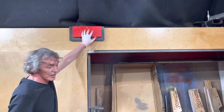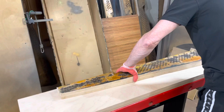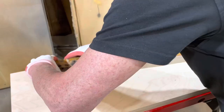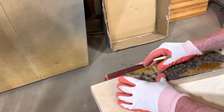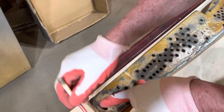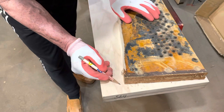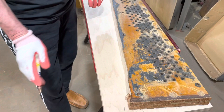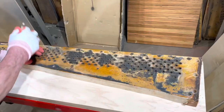Of course we have the place with the lights — always lights, it's very important. You work very comfortable. You have two pieces, and as you remember the way we cut it, you just put it on the old panel. You draw the front line as a reference, draw the line on this side too. In our case we cut it a little bit more here because we're going to adjust it to the flange — that's why you need the extra wood.